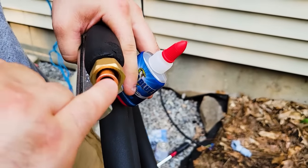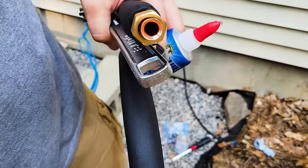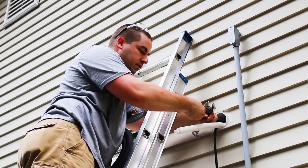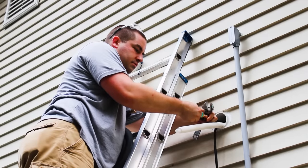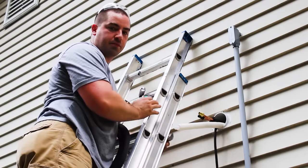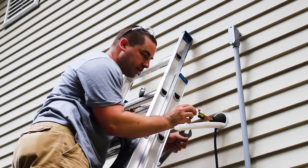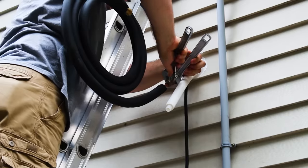And so not very much of it. These refrigerant lines are coming out from the indoor head unit, and, hear that? That's nitrogen. They pressurize the inside one with nitrogen. It's not refrigerant. The tip of this flare here can get a little bit of Nylog on it as well.